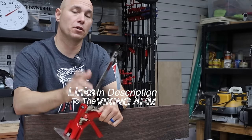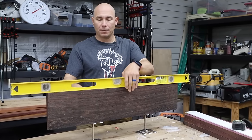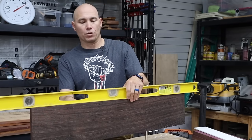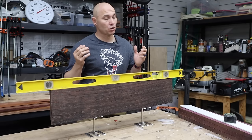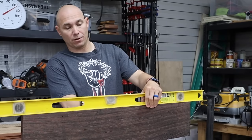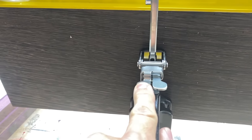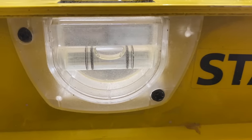I'll put links in the description below to these tools if you want to check them out. The first thing that comes to mind is it's a lifter or spreader — basically a handheld jack — but it has a precision button on the back so you can use it to level things. If you're hanging a cabinet, this precision will let you get down until it's perfectly level. Having two of these is extremely handy so you can have one on each side, raising up to meet a certain level. If you go too far, just push the left button a little and it starts lowering back down until you get it perfect.